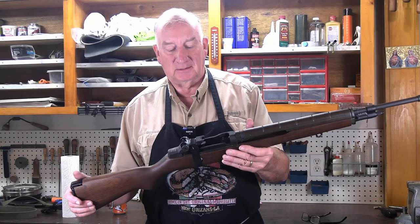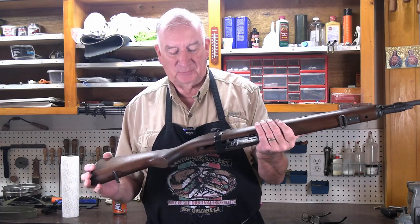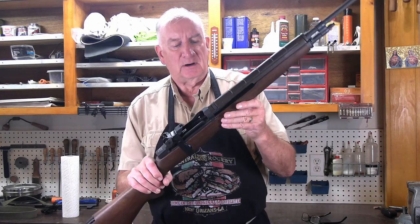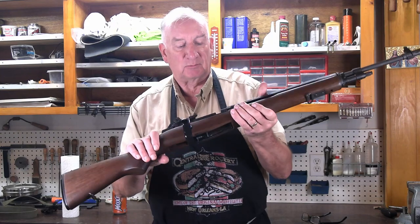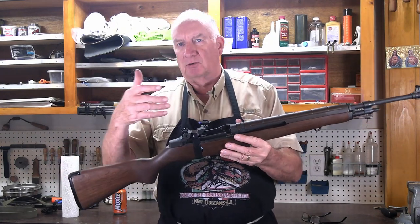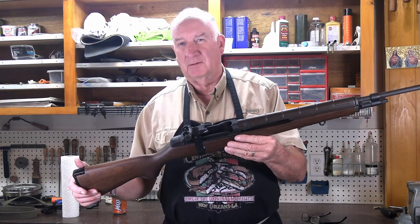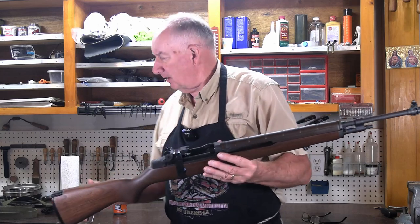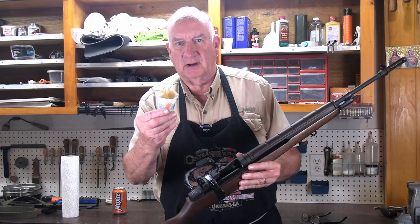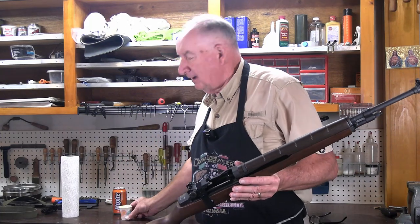I'm quite willing to bet that that's not nearly as scary a process as you thought it was going to be. I'm going to take this rifle up into a heated environment now and let it sit where it's nice and warm. You can put a heat lamp 18 or 24 inches or so away from the stock if you need to speed it up for any reason. Make sure you keep your cup of epoxy on hand. That's your gauge to tell when things are setting up.